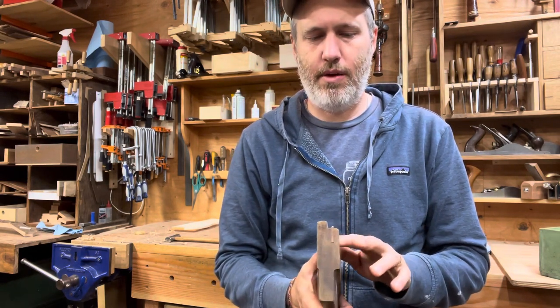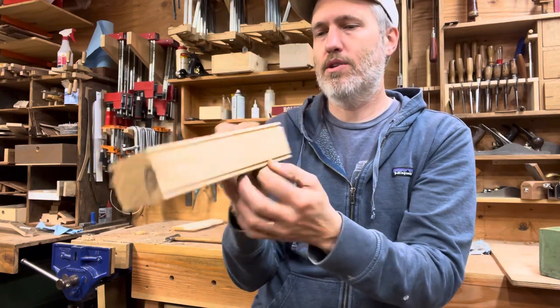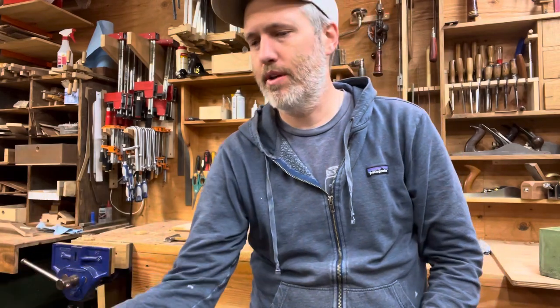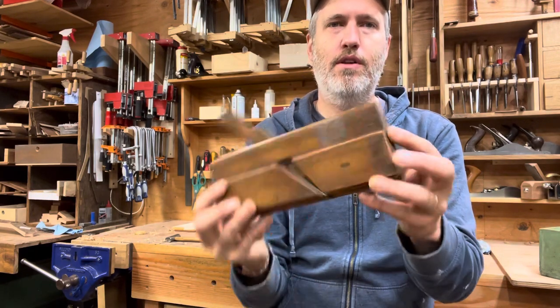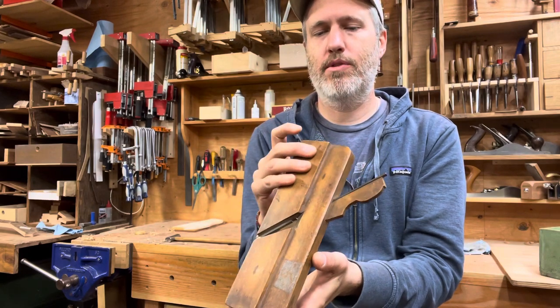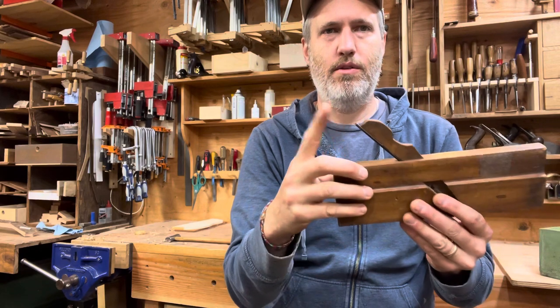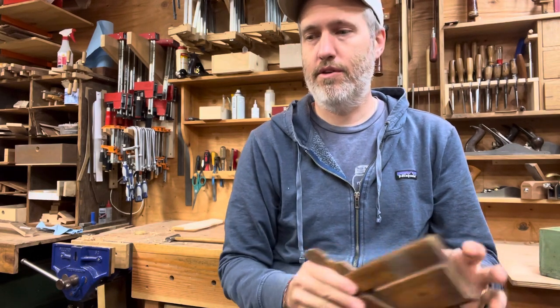A couple of these are joinery planes that would be very useful for some of the stuff I do. I think this is the kind of plane that these Hawaiian ukulele makers and Portuguese ukulele makers would use to make the boxes to put the instruments in. This one specifically is called a side bead — it makes a little rounded profile on the edge of something. I could see that on the lid of the box. It also burnishes this curved edge so that it's really hard wearing compared to a regular square edge. We already got that one going, though I do want to hone the blade. The maker on here says Ohio Tool Company, number 37, half inch. And on the back you can see places where a hammer has struck to adjust the plane — you drive the iron and wedge down with taps here, and you back it out by tapping the plane here. It feels good. We got it cutting last night.